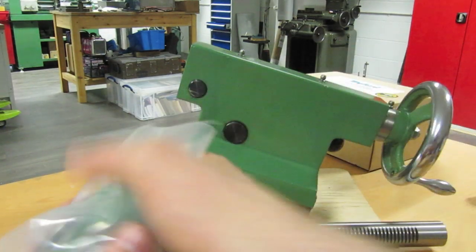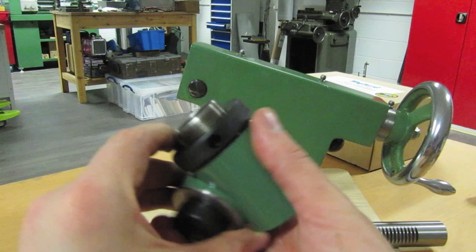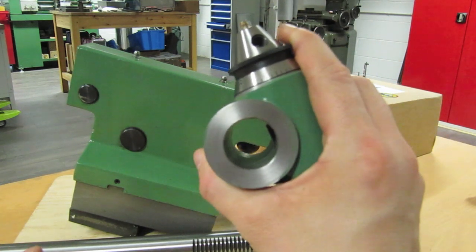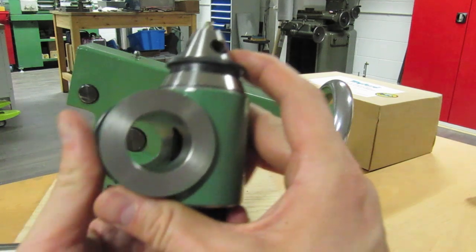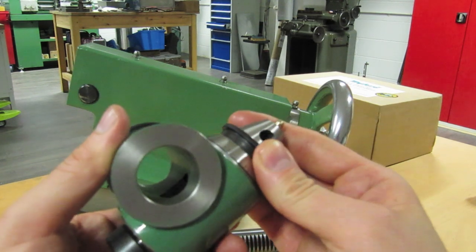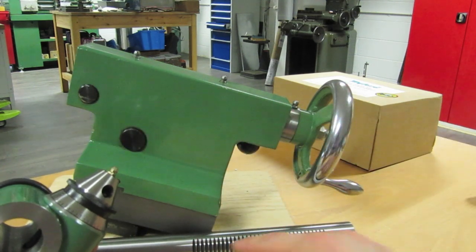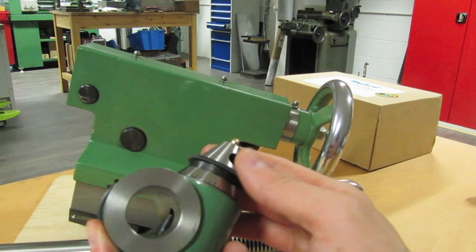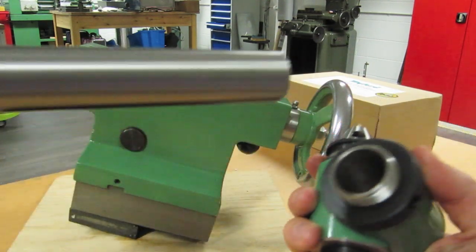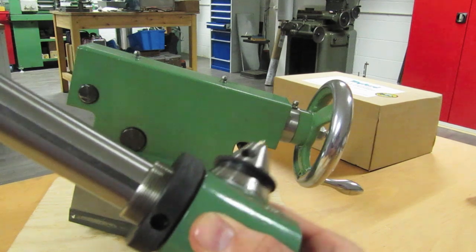What we have here is this component — a right-angle casting — that fits onto the tailstock in exactly that orientation. You have a through bore and within the bore this component has a wheel or a gear that engages with the milled teeth in the barrel. So by spinning this, you drive this barrel forward and backward. I'll insert this just as a test — it's not oiled or anything — and just give it a dry run.